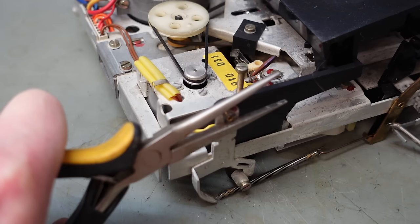Well, the voltage reading's pretty stable. Oscillating a little bit, but that motor's starting and stopping. Yeah, the voltage isn't disappearing though. This is looking like it's mechanical. I didn't notice that happen immediately. I was looking at the meter too closely. I'm thinking this is a mechanical problem. Something's binding up. See if I can undo this.